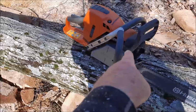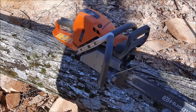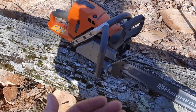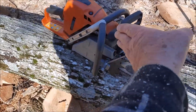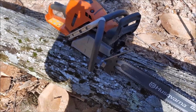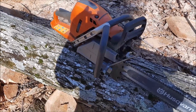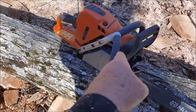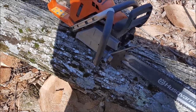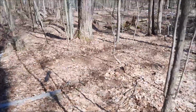And of course, remember that both the 585, 592, 565, and this 572 have the internal clutch, the clutch is inside, and the external sprocket. So these little day-to-day operations of adjusting the chain or changing the bar and chain, stuff like that, are easier on these saws. Now, on this saw, prior to having this goofy full wrap kit, had the captive bar nuts, and I thought that was an advantage. But anyway, let me finish this and we'll go right to that.